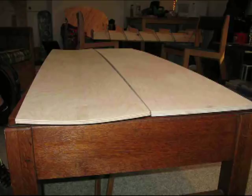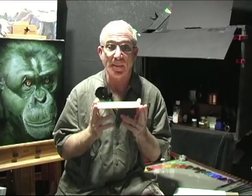This is a very thin piece of plywood known as Baltic birch. You can purchase this from a hobby store or online. This piece happens to be 1/8 of an inch thick. The problem with this type of wood is that it is vulnerable to a significant amount of warping. To keep that from happening, you can sand and varnish both sides before applying a painting support. While it is, I think, lightweight, due to the warping and the work involved, it is my least favorite panel to work with.